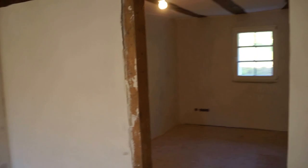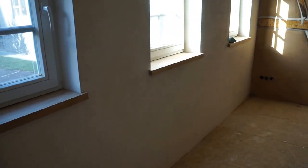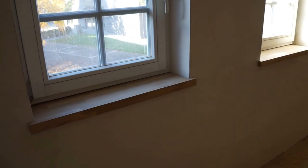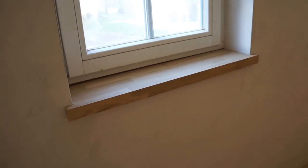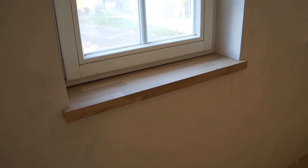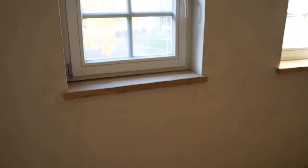This is the potential bedroom area, and my office behind it is done. You'll notice the internal window now has a windowsill — that's something I've been doing over the past couple of weeks, creating new windowsills. We have 30 to make in total and I think I've got 13 made already. These use oak boards that are only 18 millimeters thick, so we're cheating a bit by gluing a strip onto the bottom front to make them look thicker. They've been rough-fit but not finally fitted yet — I still need to sand them and use a router to put a slightly rounded edge on them.